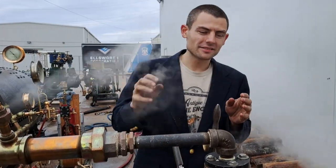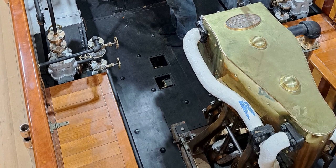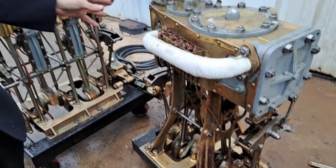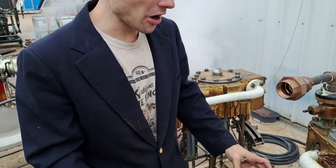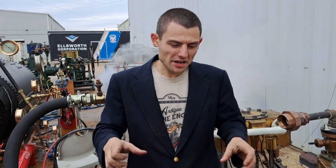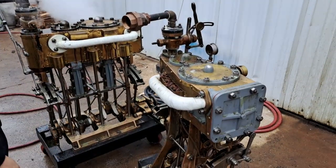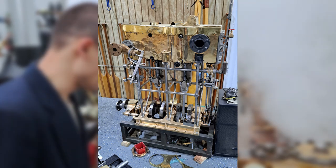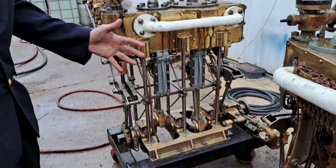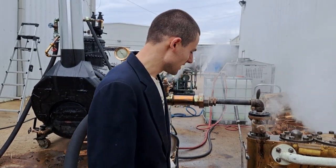Each letter was a different type and it was not an orderly scheme — things did not go from smaller to bigger A, B, C, D. They're all over the place. For instance, the E type in New Jersey and the G are very close together in size and build, with a similar frame and block. You'd think, what does a Navy F look like? There's probably something right between the E and the G. No — it's much smaller than both of them. It's very European, with a radial valve gear and two cross truss frames — you can fit it on your coffee table. A B is like a smaller version of this. This is a K, and the M is a bigger version of a K. The K is almost just a shrunken M. The M's were made in port and starboard pairs for a twin screw ship. I don't know if the K's were made in port and starboard mirror pairs. But that's a K.